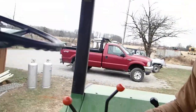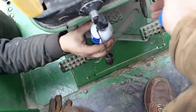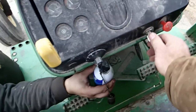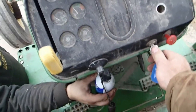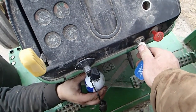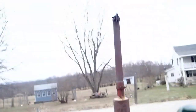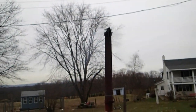Anyways, do not push it yet. So what you do is you get your tractor key turned on, you set your throttle just a little bit, and you start the thing to spinning. And then when I get it spinning, Tim's going to push up on that can, and she's going to fire. Ready? 1, 2, 3. There it is. 1, 2, 3. Push it.